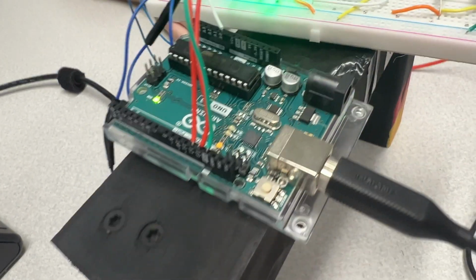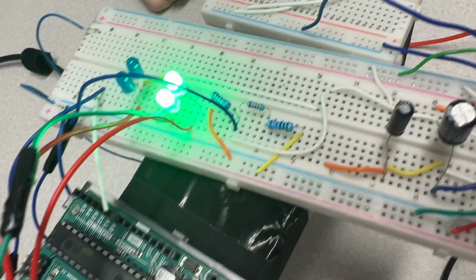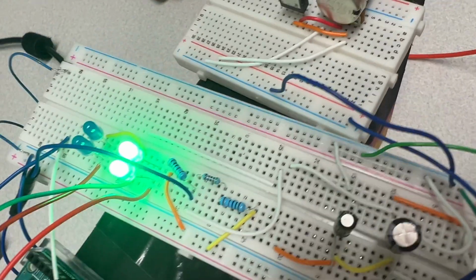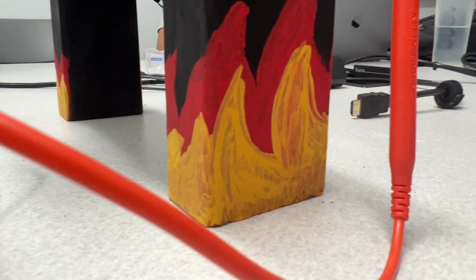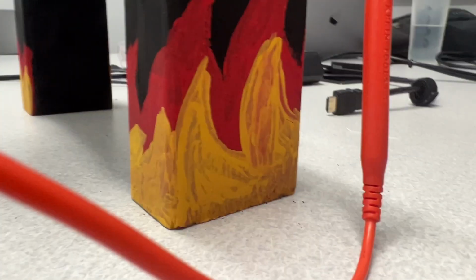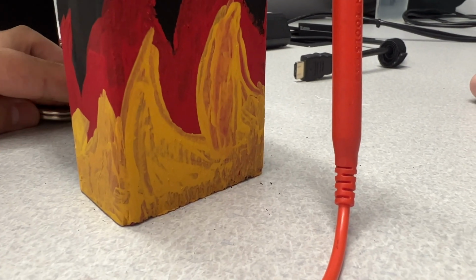The components used in this project were a 12-volt magnet, an Arduino Uno microcontroller, an AC to DC converter as a main power source, a Hall sensor, a voltage control circuit for regulating the magnet strength, an LED indicator so we could easily monitor the Hall sensor's response to the magnetic force, and then we used a 10 centimeter mounting setup for suspending the magnet and conducting our testing.